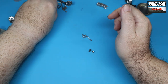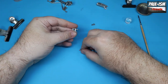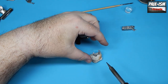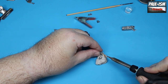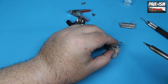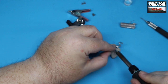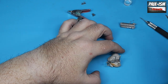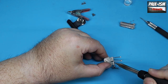So we've got several components for the pedal box. This is quite tricky to solder. So I tried a few different ways for doing it, and the easiest way for me was to get some white tack, pop it on the bench, push the part in, get them roughly where needed, get the flux in place, and then use your free hand to hold while your other hand does the soldering. All you need to do is do a quick bead, hold it in place, and then you can move around to the other side and get the pedals in place. And again, hold them gently. The solder dries almost instantly with a quick blow. A quick blast of air from your mouth will quickly dry the solder. So it's quick and easy to work with.